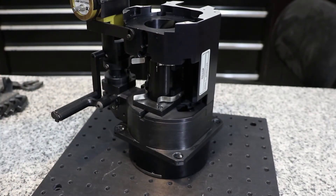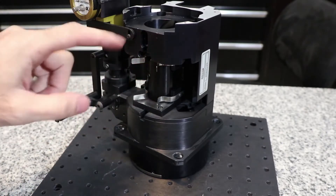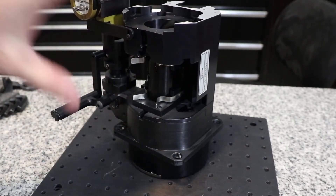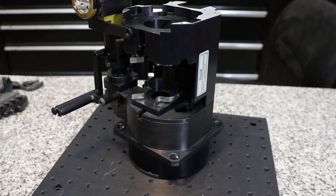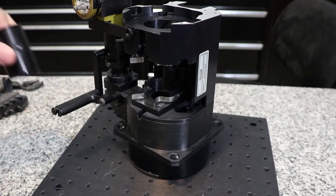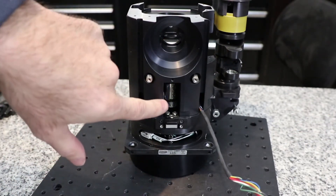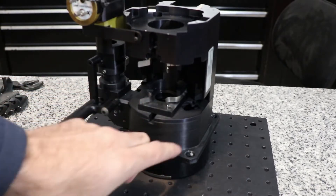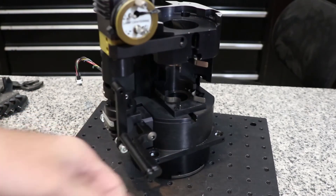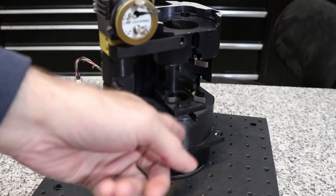To recap the whole optical axis: the camera sat up top, the thumbwheel adjusted the camera height, there was a beam splitter port not present on this model, and this interchangeable optic is 1x with nothing in it — if it were 2x, 3x, or 4x there would just be a lens down in this tube. In the back there's a little finger motor and an optic that moves — that's the fast scanning axis, which I can't get into without fully tearing down the main body.